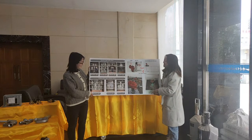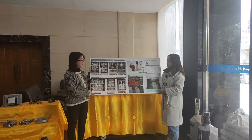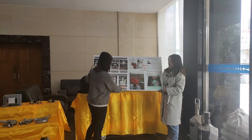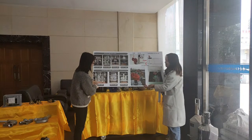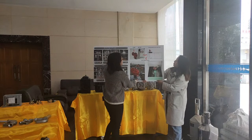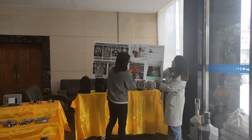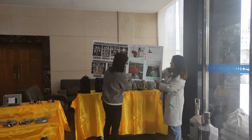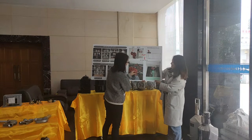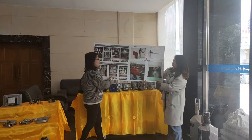The second is the submersible type. Oh, there isn't a pump and a motor. Why? Because with the submersible type there's no pump and motor inside each fuel dispenser, but you can put one submersible pump into the tank and push the fuel to the fuel dispensers. You can see there is a large pipe, right? The motor pushes the fuel into the pipe, and one pipe is separated into several holes, and then the holes connect to each fuel dispenser.